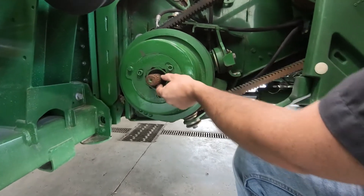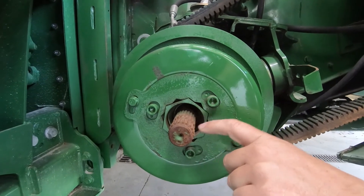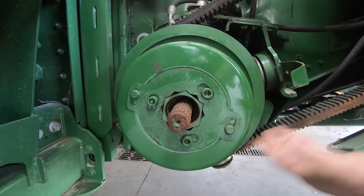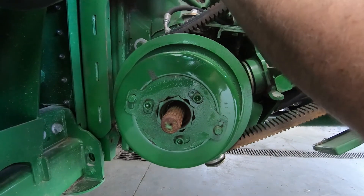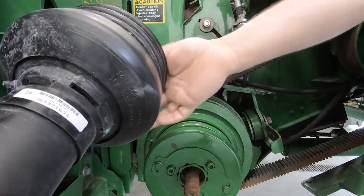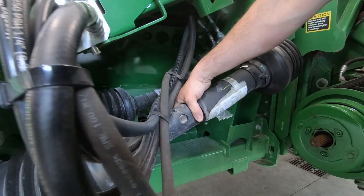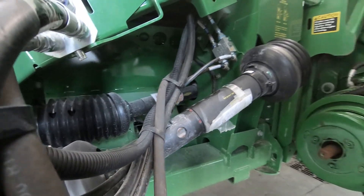When you hook your power shafts up, make sure that your splines are nice and clean. This one here you can see just from sitting over the off-season — you get a little bit of corrosion and rust on there. Clean it up really good with a wire wheel and then put a thin layer of lubricant — some fluid film or thin grease — just to keep the splines lubricated. Also check for grease fittings on the actual universal joint; you'll see a grease zerk in there that you should lubricate. It makes coupling and uncoupling the drive shaft much easier.